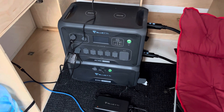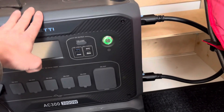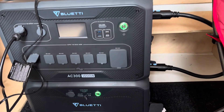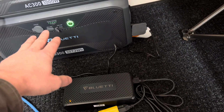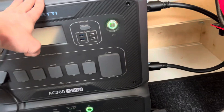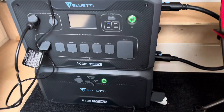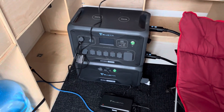For DC to DC charging, the charger inside cannot be turned down enough to handle the load through the small inverter — that's why we're using this 500-watt adapter to charge the battery. So we only have 500 watts going in, but we can use over 500 watts out — over 1,000 watts — without overloading the inverter used for DC to DC charging. It's a roundabout way to do things, but it works very well.